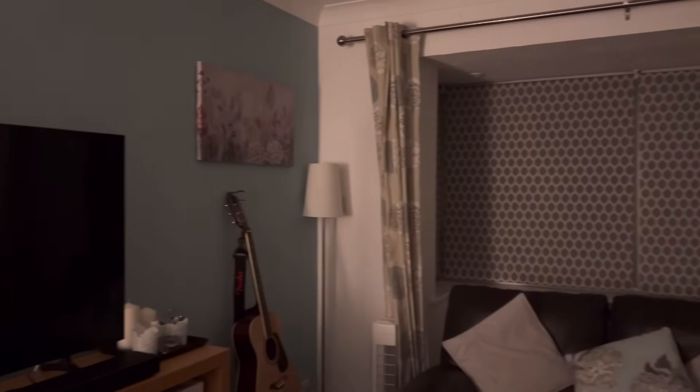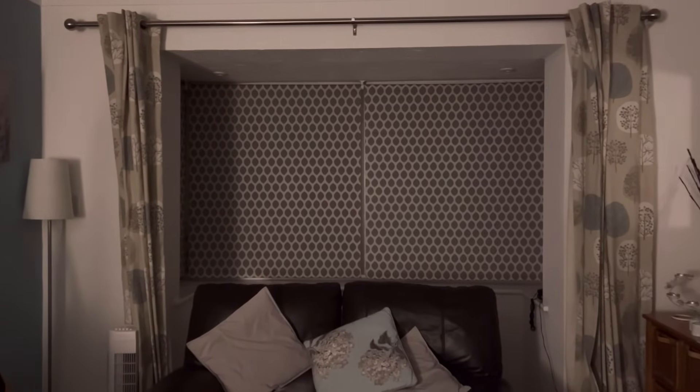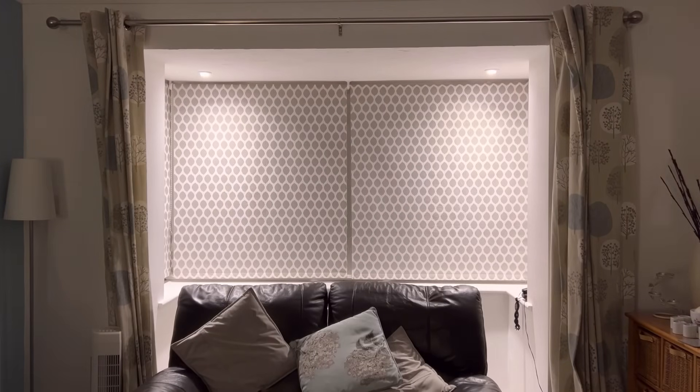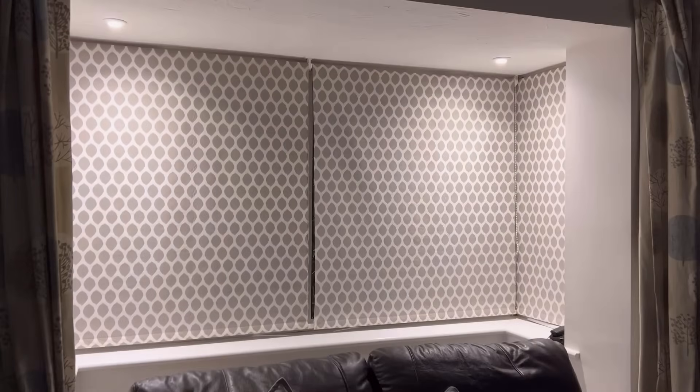Another great feature is highlighted by the location I've installed the fittings in here. This bay window area is always a little oasis of gloom in the evenings, especially with the big light on. They have an efficacy of 100 lumens per watt, making them super efficient, and rated at 6 watts, so they have an output of 600 lumens. 1200 lumens in this tiny area is a bit excessive — we're looking to lift the gloom a little, not make it visible from space. So it's a huge advantage that the fittings are dimmable, and I can dial their brightness down to a more suitable level.